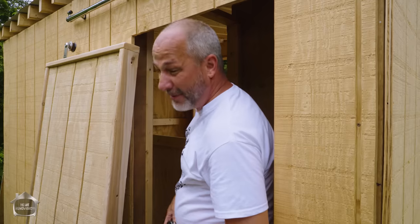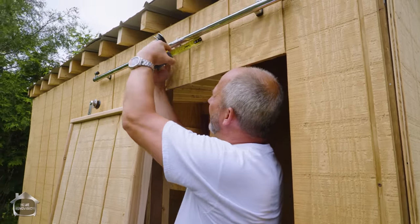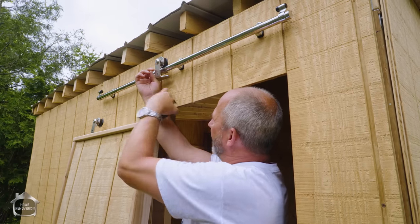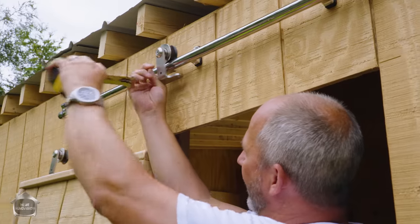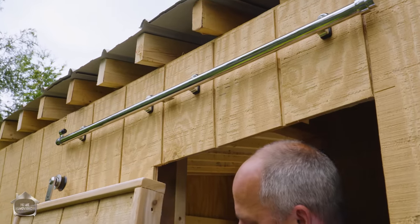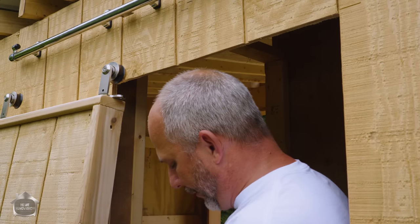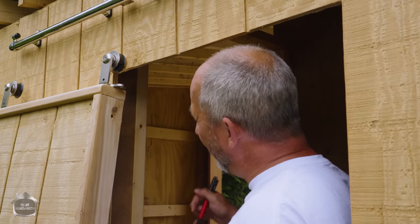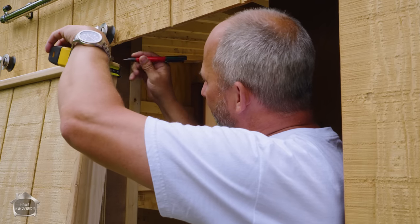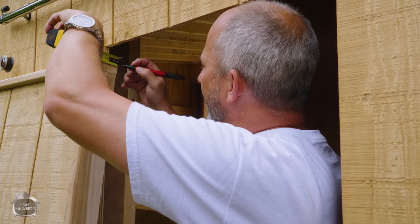Whenever you're building something custom, always take the hardware out and then measure without it installed first. So from the lead edge of this bracket when it's perpendicular, I've only got 3/4 of clearance. When I'm placing my bracket, I want to be mindful. 3/4 is too perfect, right? But I'm thinking half an inch would be nice. So let's just go half an inch back.